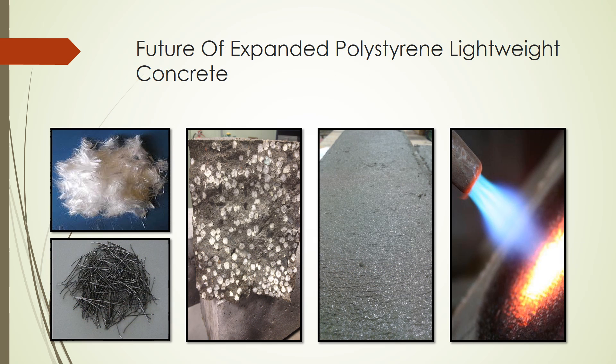There is room for improvement. We would like to examine the use of different adhesives applied to the expanded polystyrene beads in place of paint, and investigate ways to refine our mix design to further improve the concrete's compressive strength. We would also like to use fibers such as steel or polypropylene to increase the concrete's tensile strength, and test the expanded polystyrene concrete's fire resistance, insulation value, and sound resistance. This would allow expanded polystyrene concrete to be used for a variety of applications.